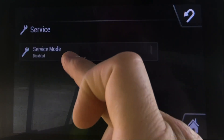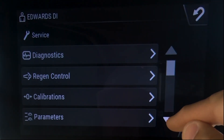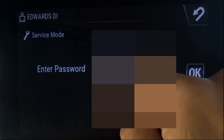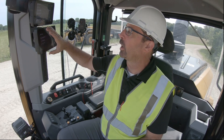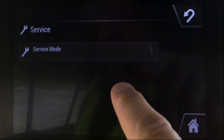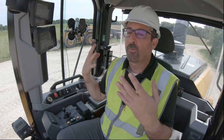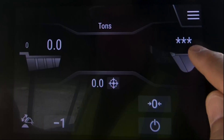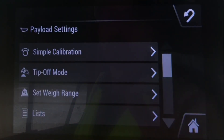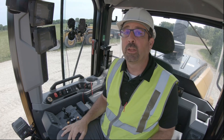Then you've got your service menu. Service mode is disabled by default; if your dealer is going to calibrate this system, you go into your main menu, enable service mode, and at that point you can go into service mode on the advanced payload, into configurations, into calibrations — and that is where you would actually run through an empty bucket, a full bucket, and a calibration weight for the initial calibration. If you find you need fine-tune adjustments later on, the simple cal feature set is also built into the scale. These are the feature sets of that scale, and we're going to get into individual modules showing you how each of those work.